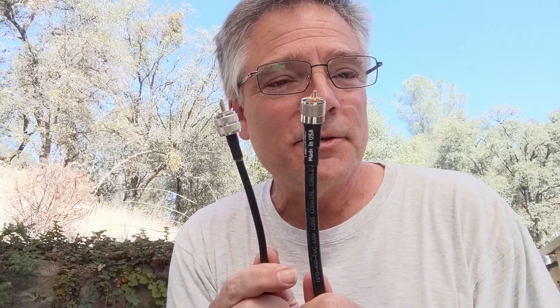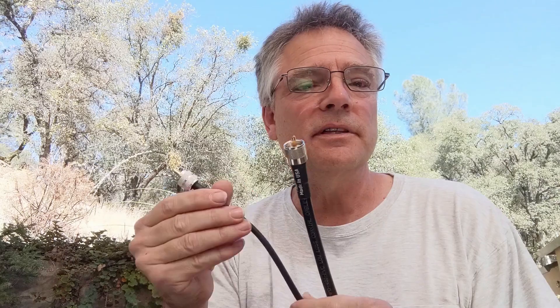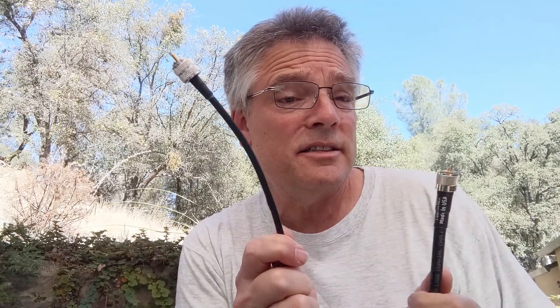Thanks for hanging out with me in the field today — who am I kidding, this is the backyard. Let me know what kind of coax you're using. There are dozens of different kinds at different price points, attenuation levels, and flexibility. Maybe we could come up with a quotient — price per foot per attenuation per watt loss — and really see what coax is best for you depending on your frequency and run. We've been testing VHF all day. For HF, RG-8X actually makes a lot of sense because there's less attenuation at lower frequencies. But if you're mostly using UHF, LMR-400 is probably going to be your buddy.